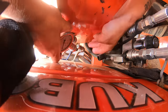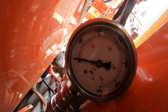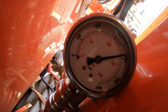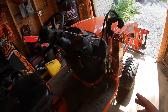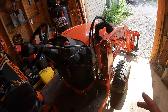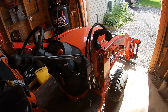We'll go ahead and throw our pressure gauge on — I'm going to use this first coupler here. Okay, I got you guys set up in front of the gauge. I'm going to start it, bring it to full revs, and we'll see what this pressure gauge reads. All right guys, so as you've seen it was actually at 1,950 PSI, which is perfect — that's going to be the best case scenario when you guys get this tractor if you buy it brand new. Best case scenario it's going to be at 1,950 PSI if you're lucky. Most of them will ship out between 1,850 and 1,900. Some will even be lower, like 1,750 or 1,800. I think that's about where Kubota sets them from the factory when they're actually set properly. So let's go ahead and go back there, get the pallet thrown on the forks, and see how many cinder blocks we can lift.